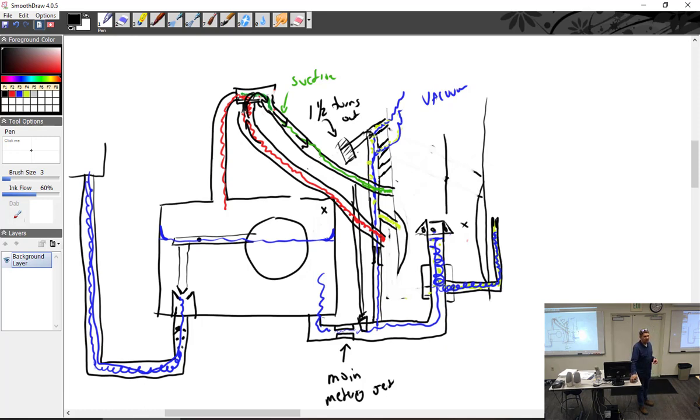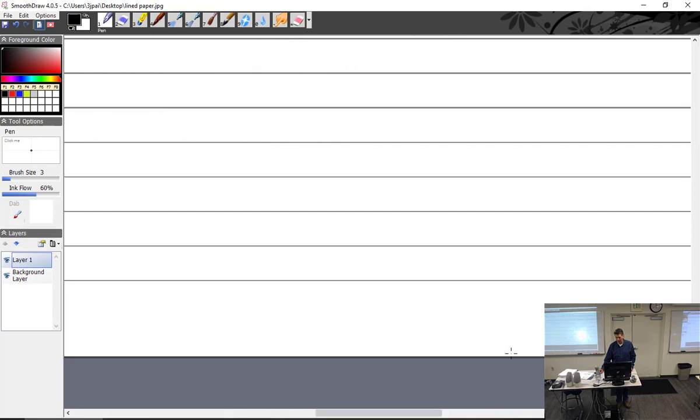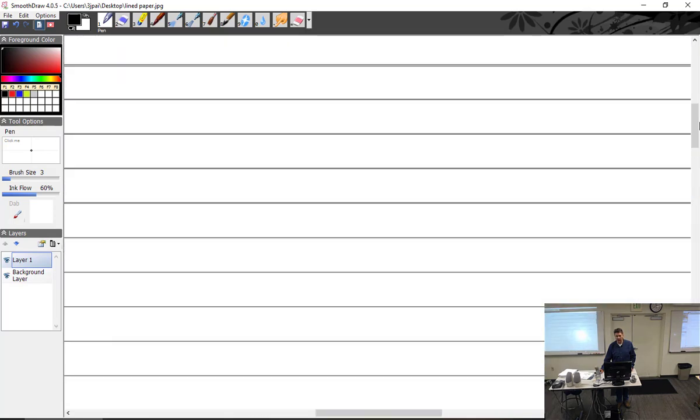So there's a relationship that you have to understand between the two. If I've locked in the throttle, I'm not moving the throttle, and I start screwing in the mixture until it gets super lean, what's going to happen to the RPM? Okay, RPM is going to drop. So write this down. We screw it in, the RPM is going to drop because we're going lean. Well, what is the manifold going to do? That's manifold absolute pressure. It's going to go up.